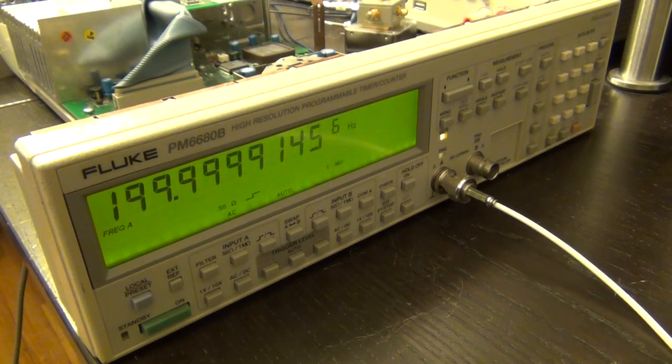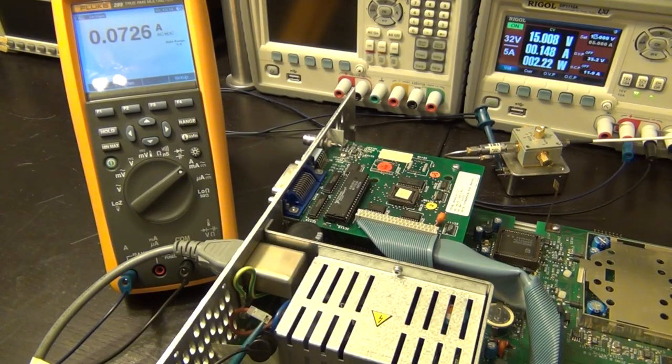There's only one other thing I wanted to do, just to measure its power consumption, and that should be it. So there was something else I wanted to quickly measure, and that was the standby power consumption of this unit. So right now it's turned off, and as you know, the power supply is actually on because this thing has a soft power switch. And look, it's burning 71 milliamps from 120 volts here in the United States. Why? That's almost 10 watts. What is it using 10 watts for?